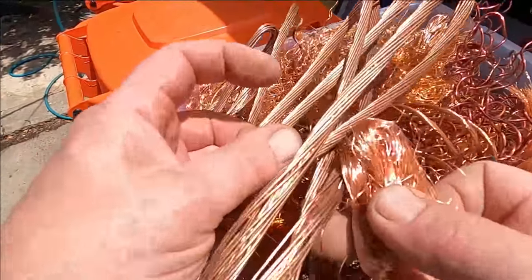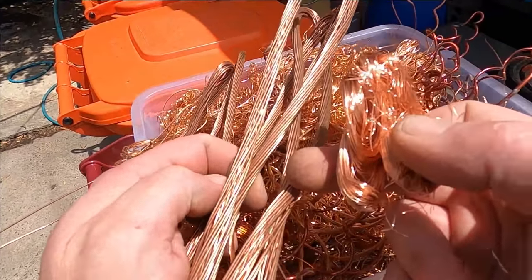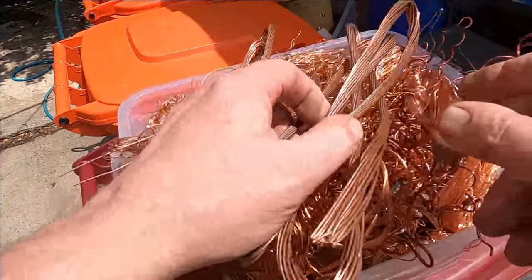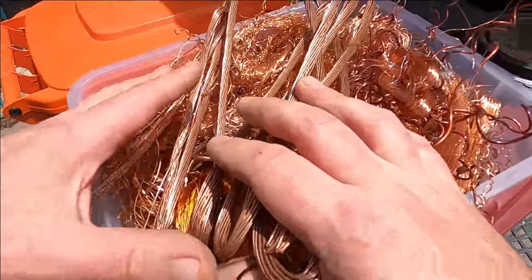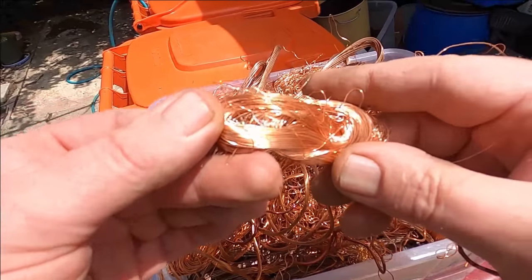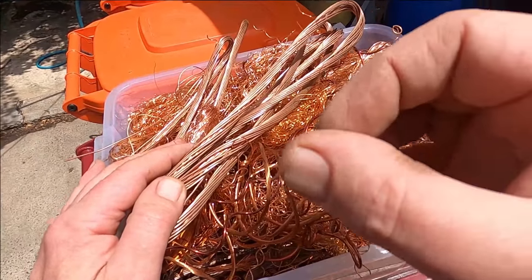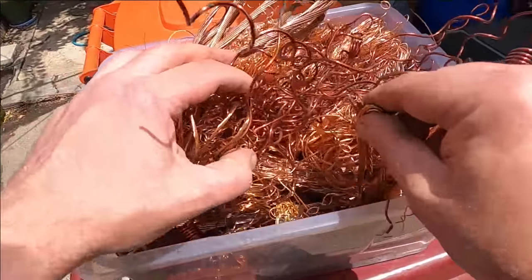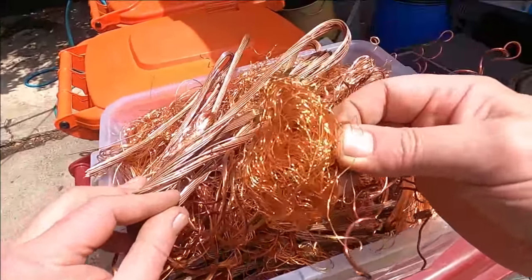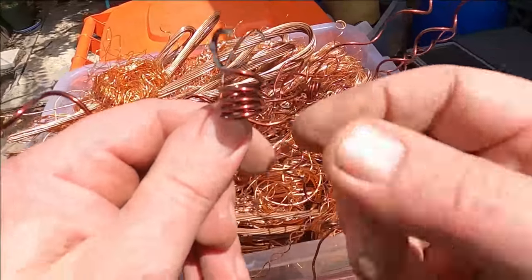This kind of copper here, again, this is bare bright also. The only thing is, because it's been sitting around for a little while, it's got a bit of tarnish on it, but it's actually still bare bright. So I just wanted to point that out. So when you're starting your furnace, always try and use bare bright or old ingots that didn't turn out, where all the lacquer's already burnt away. Then once it's melted, you can start adding your dirtier, slightly lacquered copper to that.